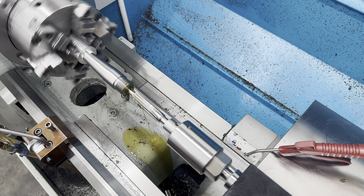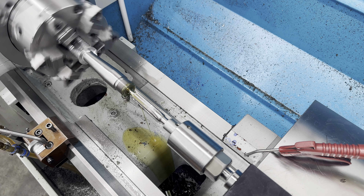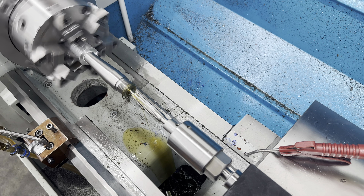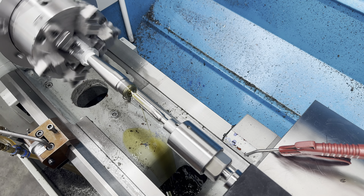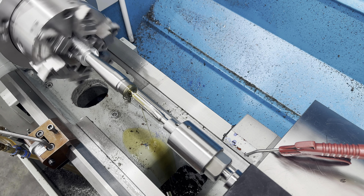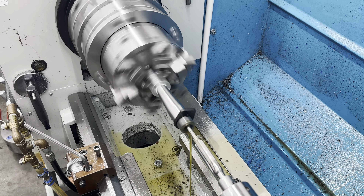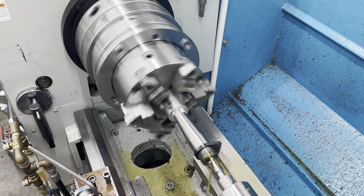I got the oil pressure flush system drained, bled out the air, got my RPM set. I ream at 145 RPM and once I get up into here I let the carriage feed take over, cutting at one and a half thou per revolution. That gives me a beautiful finish inside, much more consistent than doing it by hand.